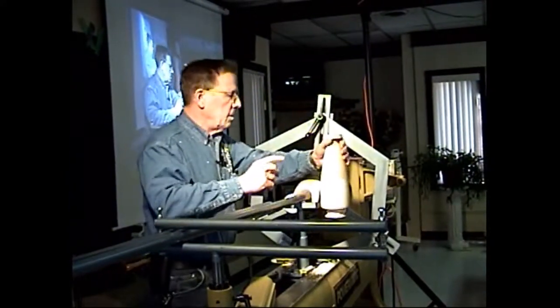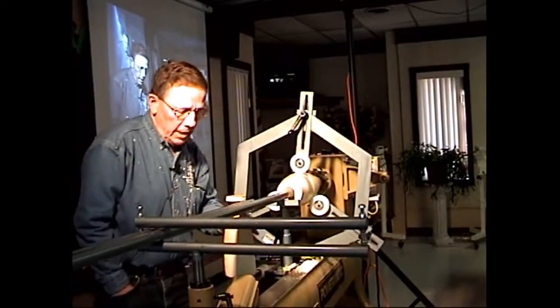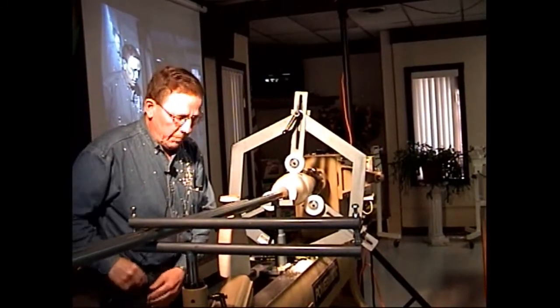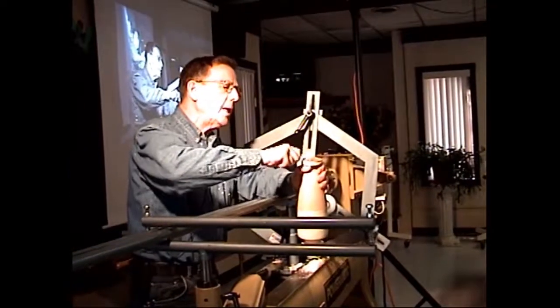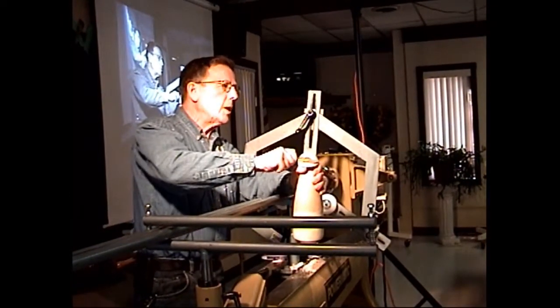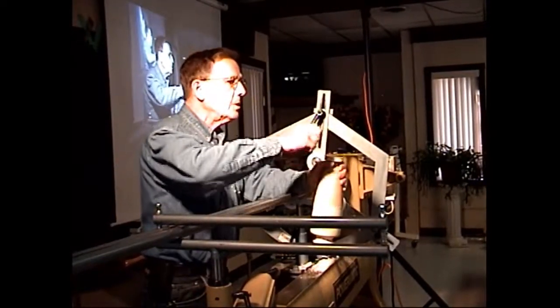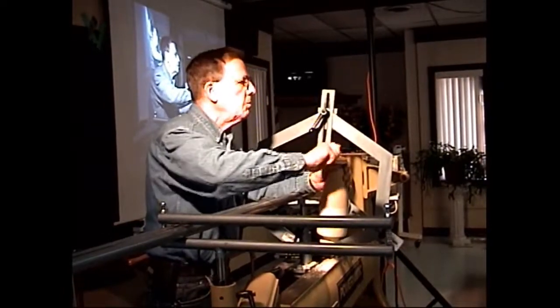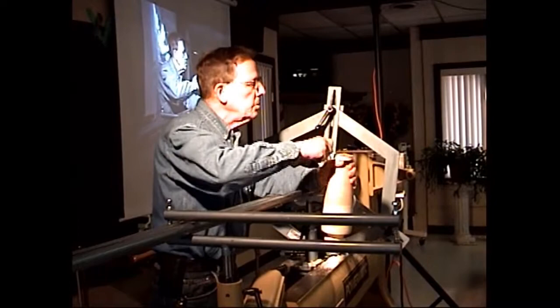If you had this vessel here and you wanted to take a 1/16 of an inch off of the end of that, and in order to do that, somebody gave you a knife blade like this, would you cut that off like this, or would you try to take it off pushing the knife sideways? Obviously, it would move much more easily going this way than it would this way. This is cutting, this is scraping.